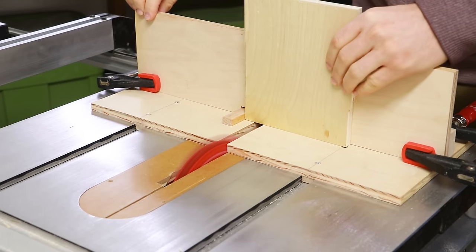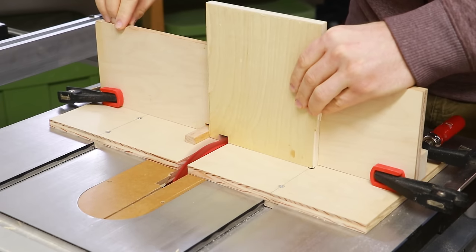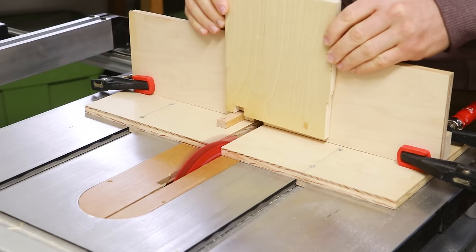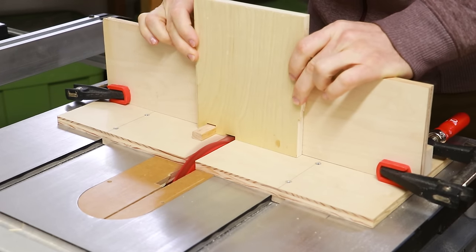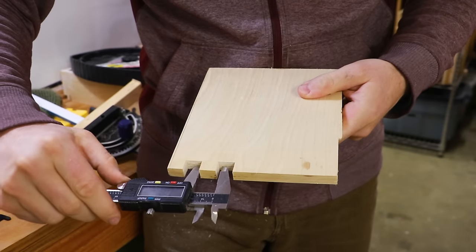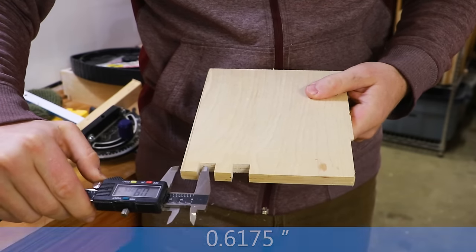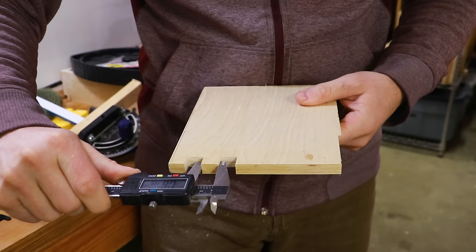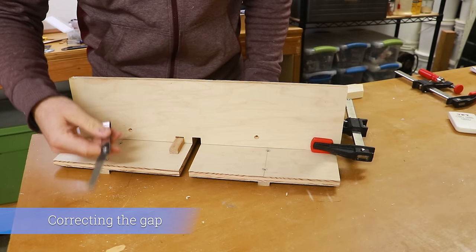When testing the cut I push my work piece up against the spacer and make the first cut with the dado. I make a little finger and a recess. That recess will go over the spacer to make my second cut, and this cut will create another finger. That finger between the two cuts will be measured. With the calipers I can measure the gap — we're hitting pretty close at 0.617. That's really good, though it's not quite three thousandths of an inch less than 0.620, so I want to make a little shift.